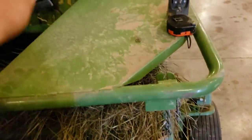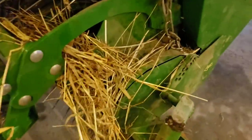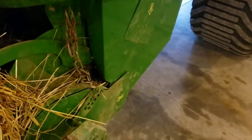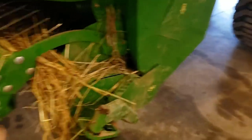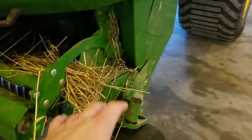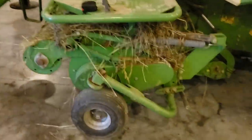Also similar, both designs have the roller baffle, which pushes the hay down and helps in feeding. The Krone teeth do not have any oscillation — the bands give the illusion that the teeth are disappearing. On the John Deere, there's a cast end that makes them run through cams. I'm going to give the victory to the Krone on simplicity by eliminating those cams. The roller wind baffle is a draw. Simple to set goes to the John Deere. Ease of work on goes to the John Deere. Width goes to the Krone, but pickup height goes to the John Deere.